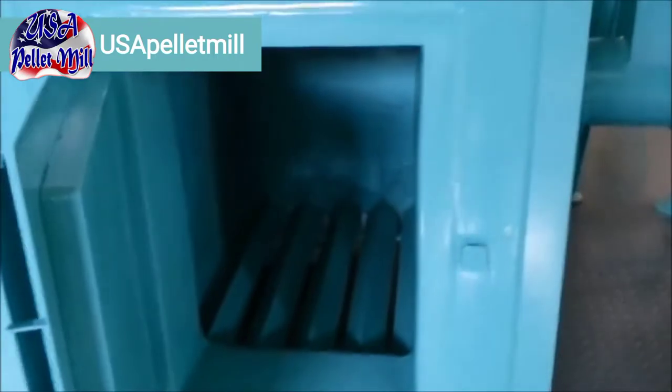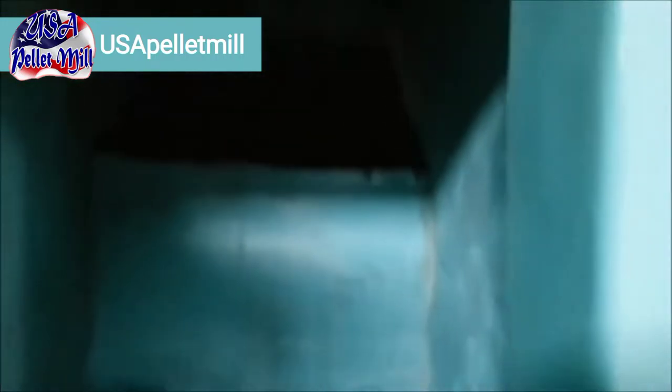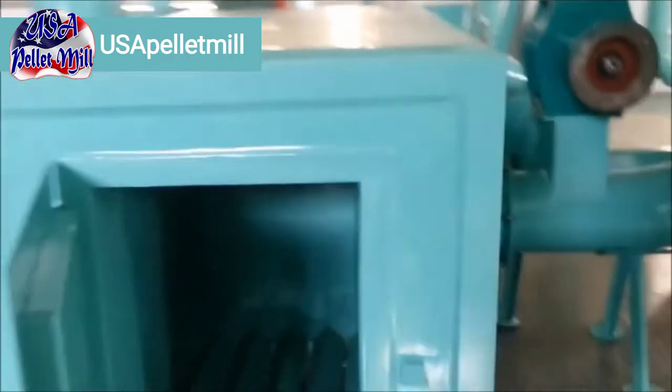You really want to have moisture below 20% when it comes to wood. So here's your furnace — you're going to fill this with logs, wood logs, charcoal, whatever you want to use to create the heat for the dryer.